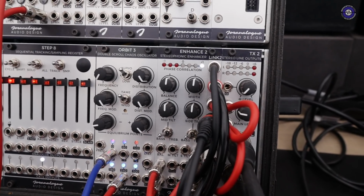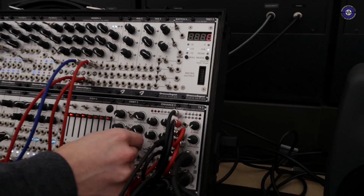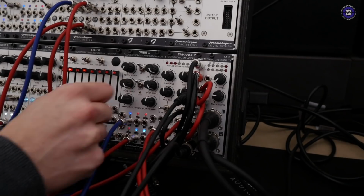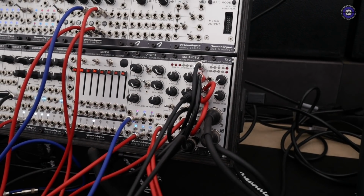So it's an oscillator in there, and it's not much more complex than you would find in a standard oscillator, but because of some tricks in there, it has this very strange, irregular behavior. You can look at it as a particle orbiting around two equilibrium points. And these points are modulated using the parameters on the module, with the knobs and CV controls. So we move the points about throughout the 3D space.